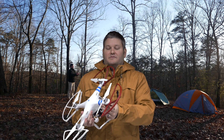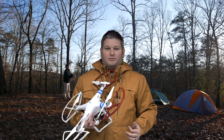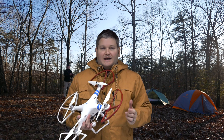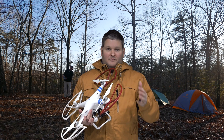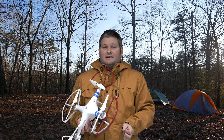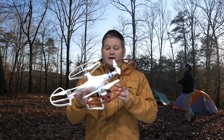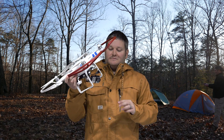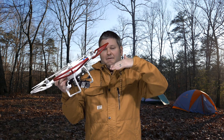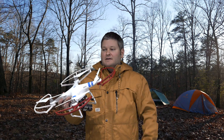Now there is an additional step: after you update the firmware, put your Phantom 2 Assistant version 3.8 back on there. Remove your 3.6 and put 3.8 back on your Mac, then go into the 3.8 software where you can calibrate the Zenmuse H3 3D — set the maximum downward position, the maximum upright position, as well as control the speed of the tilt.